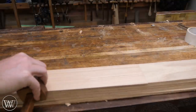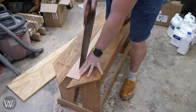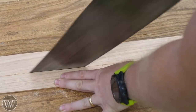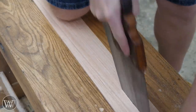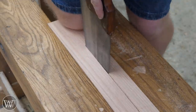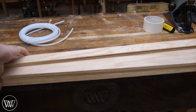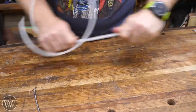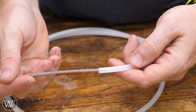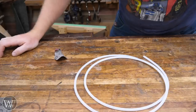For one of these I'm actually going to rip it right down the middle. I need to create a track in the middle - I did it for two of them because I need it to be a little bit thicker. You have to be very careful with thin stock like this: it jumps around on you, and if you push the saw really hard you're going to end up splitting it right down the grain. Now I have four of these thinner strips, and those are going to go in the middle and allow me to put this hose down through it. This hose is where a cable is going to run through this curved surface. This is an eighth inch cable.